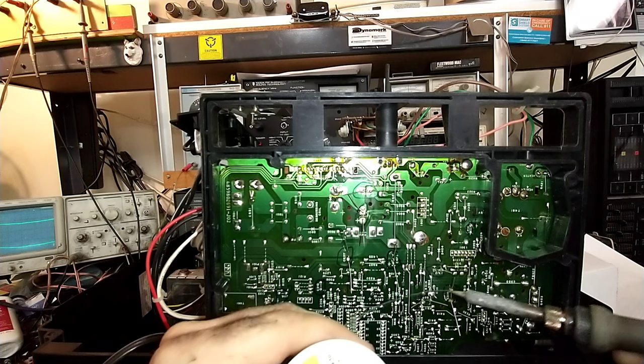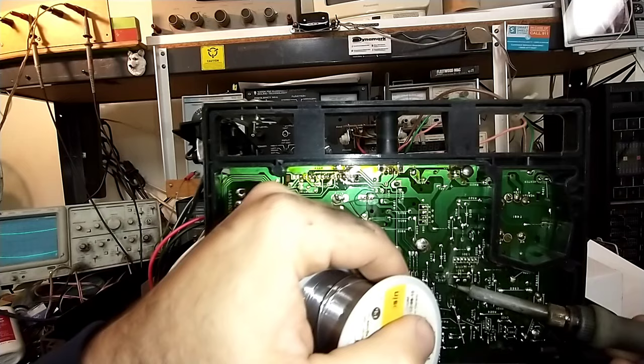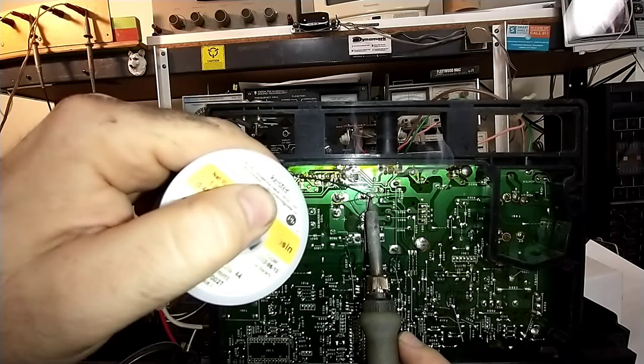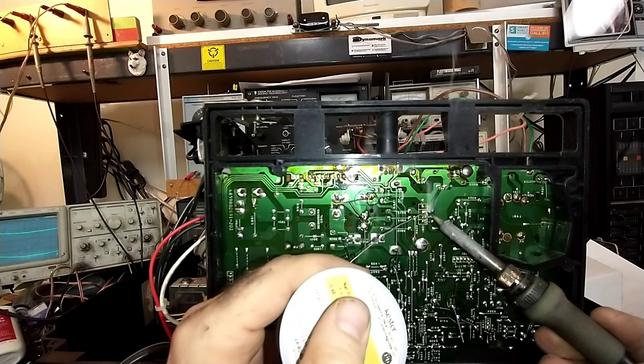I'm basically replacing the high failure rate parts, which although the ESR meter says is good, the picture on the screen tells me otherwise. So I'm definitely more inclined to replace these parts. Because typically when you see a shadow from dark to light, it's because the B-boost filter is failing, so I figured I'd replace that. Because although the ESR meter says it's good, it's probably not.